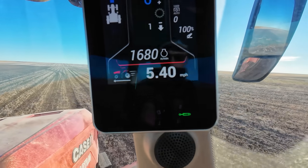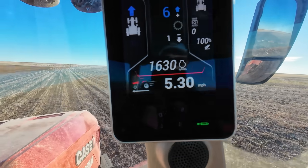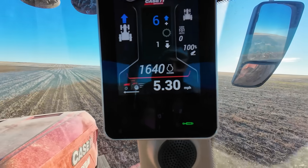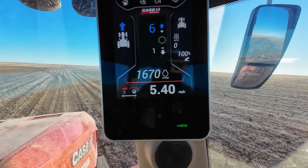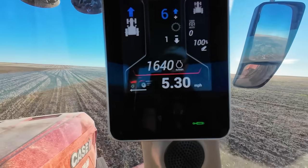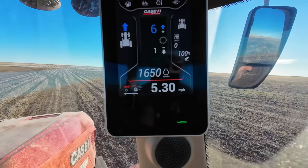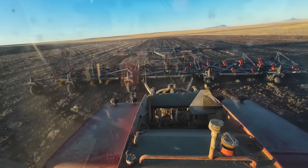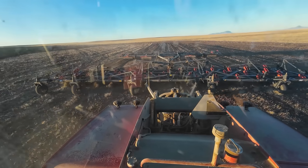I looked at it, okay, it's out of the ground. Increased 0.2. Back in the ground. See that? RPM drops from 1650. So it's out of the ground, back to 1650, 1670, in the ground, 1620. All right, so I've got the plow, sweep, cultivator buried into the field.